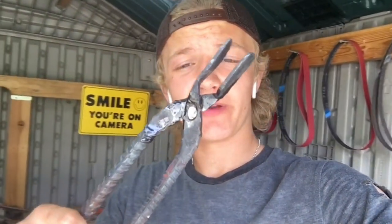And that is how you forge yourself a nice pair of flat bar tongs out of rebar. You can stop at this point if what you're looking for is a pair of flat bar tongs. The way that you adjust the thickness is purely through where you rivet — if you're looking for flat stock, rivet the jaws closer together. If you're looking to hold thicker metal like a railroad spike, get the jaws a little bit further apart. But like I said at the beginning, I want to adjust these to be round stock tongs.